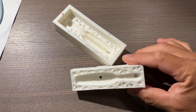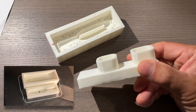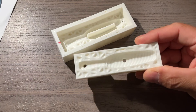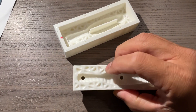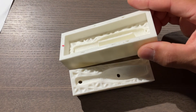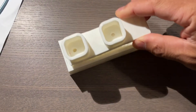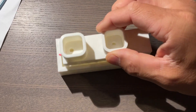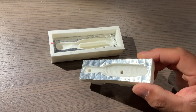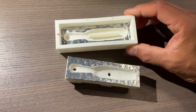So I did a round of pouring and something bad happened. The top layers didn't look like they were printed properly, and after a round of hot plastisol pouring and pressing, the surface got damaged badly. I was saying the bait-making process with this mold is like making a waffle, and now the mold really looks like a waffle maker. I tried to save this mold by adding aluminum foil to the surface — let's see if it works.